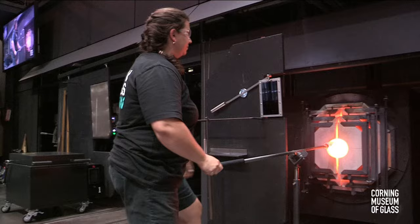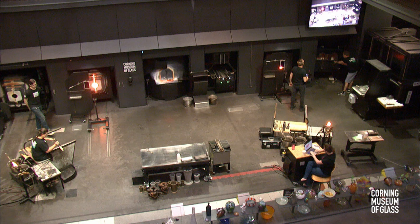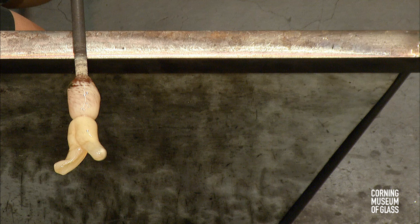And this sculpting is a great example of how the glass moves. It's solid. Well, it's also a great example of how quickly that heat does cool down. Because each time Catherine comes back from the reheating furnace, she has a very limited working time. Probably less than a minute each time she's at the bench to achieve what she's trying to do. She'll go back, reheat. And each consecutive heat, you'll really notice how the glass is moving once again. You'll see it get that characteristic orange glow.